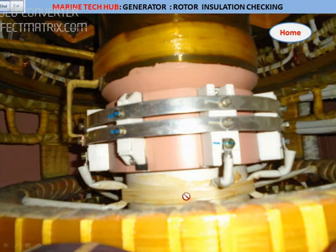For the rotor excitation, you have the star-connected stator winding — you can see six terminals coming from here. So you have to remove all these terminals so that you don't damage the diodes. Once you remove the terminals from here, then you can check the insulation by giving 500 volt DC.